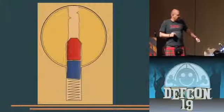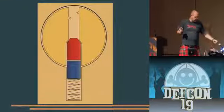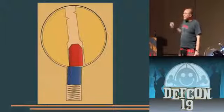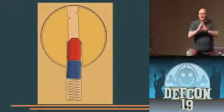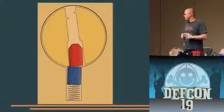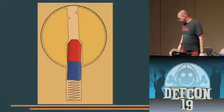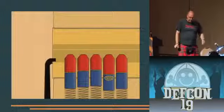And that's basically because it's not turning because the blue bit is in the way. And if we do put that pin stack down, then the cylinder will turn just a very slight angle, until the next blue bit starts preventing it from turning. But the neat part is that now this blue bit won't be pushed back by the spring because there's bits of yellow in the way. So that's cool. So what we can do with that is picking a lock.